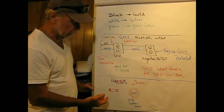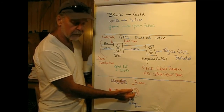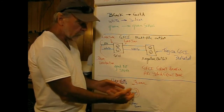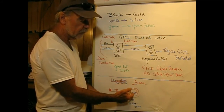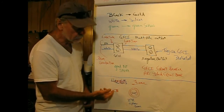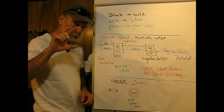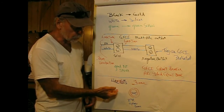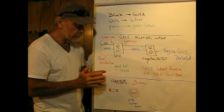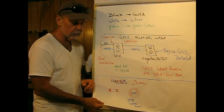Now what that's about is that if you blow a fuse and it's an inductive load, you can actually have an arc flash inside the fuse. That is, it's hot enough so that the air inside gets ionized and still conducts electricity as it slowly melts these things back and forth. Now these brown fuses are filled with sand, and so are the big ones, you know, the mains. So if you blow a fuse, the sand will fall down between both ends of the contacts and quench any flash. So if you see brown, replace it with brown. Don't replace it with glass.